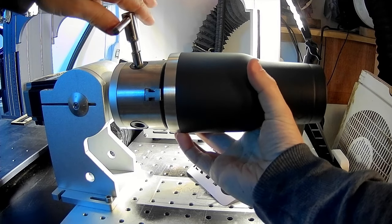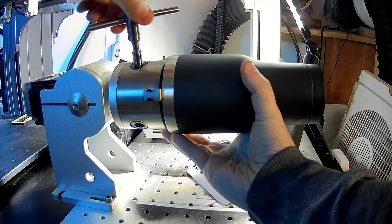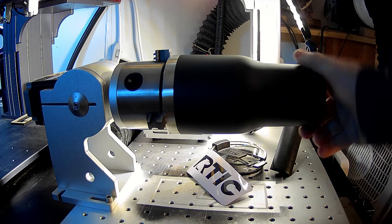It's time to get our cup onto the rotary tool. When we do this, make sure it's flush against all of the jaws of the chuck all the way around. Once we get it on, you're going to spin it to make sure that it's flush against all of the jaws. You'll see I'm putting pressure on the bottom of the cup to keep pressure on the jaw facing the ground, because our rotary tool jaws just hit their limit as it starts to put pressure on the cup. After you're done, just check them, make sure they're all flush, and you're good to move on.